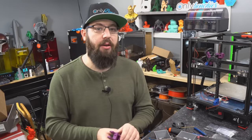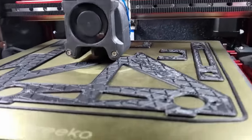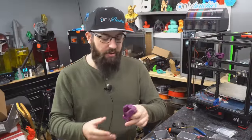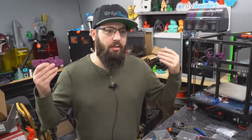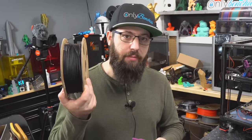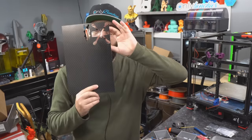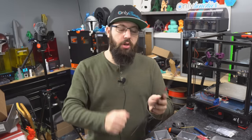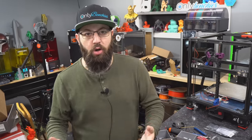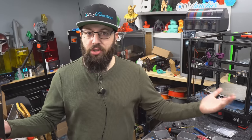We're going to do the A and B motor mounts on the V2 gantry. These parts are simple enough to redesign that pretty much anyone with a simple at-home desktop CNC, some carbon fiber plates, and the right cutter can follow along and do it yourself. We are going to be redesigning these parts partially to make them more optimized for subtractive manufacturing. With additive manufacturing — 3D printing — you're taking filament and adding until you get the final result, with minimal waste. However, you are limited to materials that can be melted. With subtractive manufacturing, you take your desired material and remove stock until you get your final result, so you can use much harder materials — I'm going to be using three millimeter carbon fiber. Anything you're removing from your stock is potentially waste going in the bin.